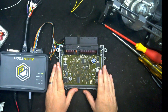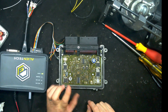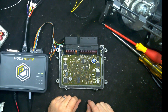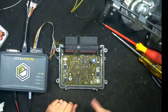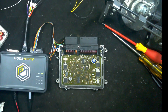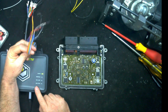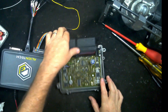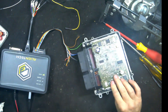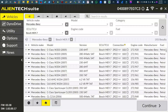I have the donor here open, and we are going to connect through BDM with it. We are going to upload the programming from the original — aka clone the original — to this donor unit here. You're welcome to follow along as I do that. We're going to use our KES-3 device here, we have our T-104 ribbon cable, and we also have whatever this cable is called — that's where we connect to some pins here. Let's take a look at the instructions.